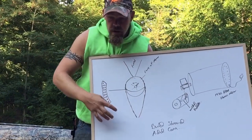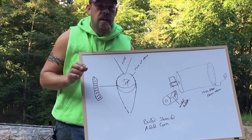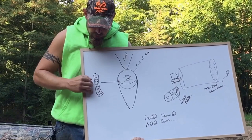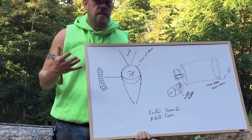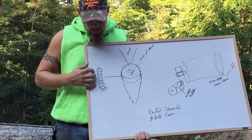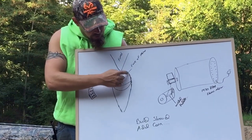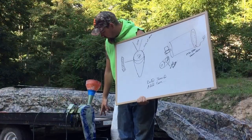After that I built a shroud to go on the face of the motor. Inside that cased shroud is a piece of corrugated metal with very small holes, and that basically gives you the size of the cracked corn you're going to have. If you want it very small and powdered, the smaller the hole, the more that happens. I went with a mid-size hole — about the diameter of a pencil — because I wanted some structure to it. I'm not cooking with it; I want the deer and animals to still have some meat to it.